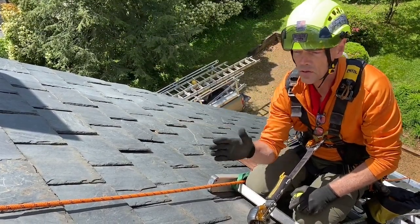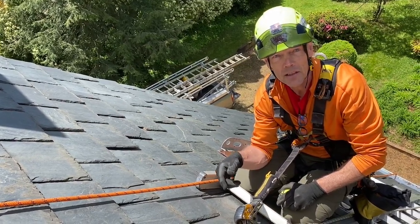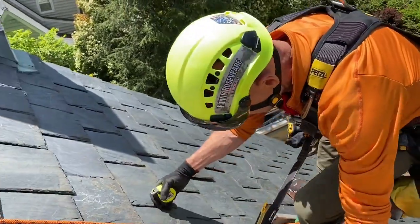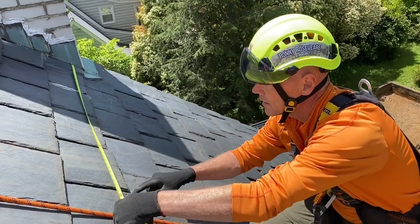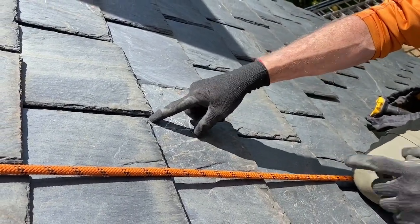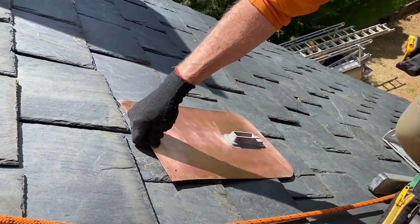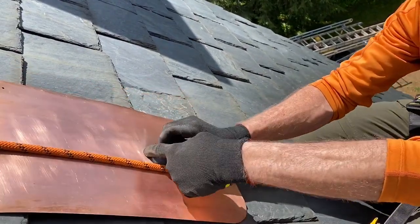I found one rafter at 45 and a half inches and another at 60 inches from the chimney. I really wanted to put the anchor on the one at 60 inches, but on closer inspection — and you'll see it in the attic shortly — there's a crack in the bottom of that rafter. So we're going to go to the one at 45 and a half. I'm going to measure about 45 and a half off of that chimney, and the anchor plate would wind up right under the center of a slate — that's an ideal location.